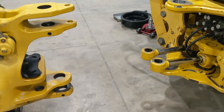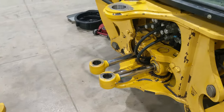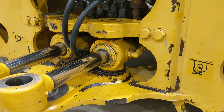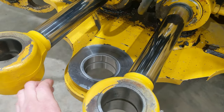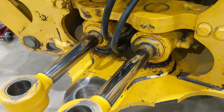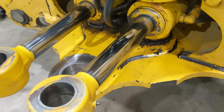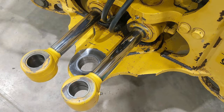Be prepared for many hours of cleaning messy grease — this took me three or four hours since there's grease everywhere on an old machine that's never had this done. Once the backhoe is off, you have much better access. I would have had to remove my backhoe valve to pull the swing cylinders, so I left them in place and worked around them. If you do the same, make sure to cover those cylinder rods when welding or hammering nearby — you don't want to damage the chrome.